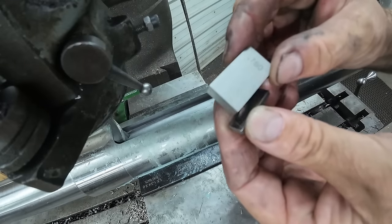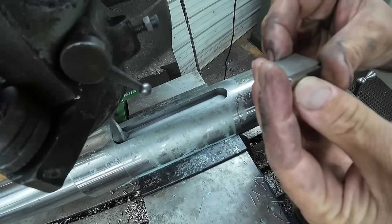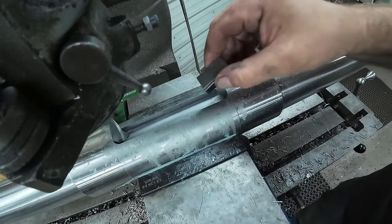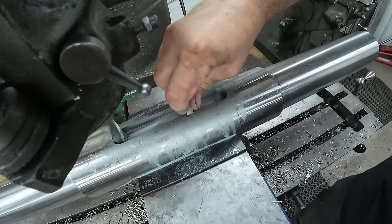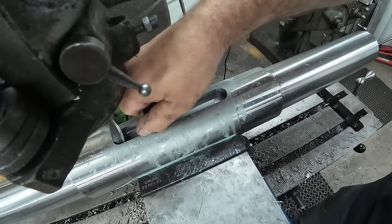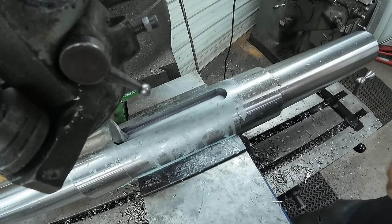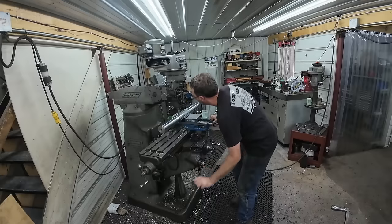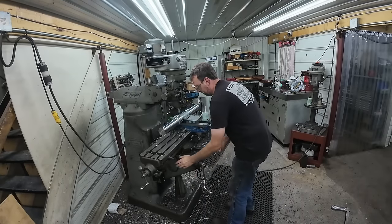All right, so here are my gauge blocks. A 750 and a 124, giving me 874 thousandths. And I checked that with a caliper and, oh, they just fit. Just right where I wanna be. So one thou under, nice snug fit. This keyway is done. Well, I'll just drop the knee down and get this out of here.